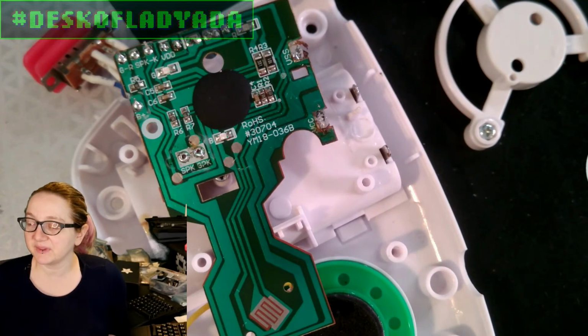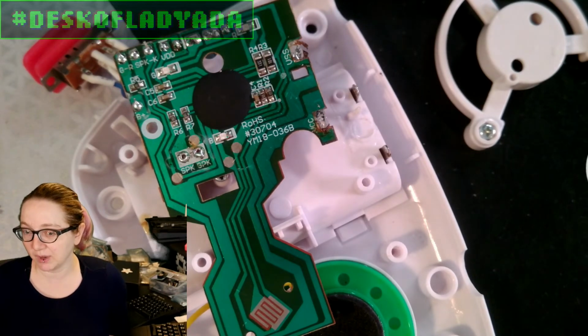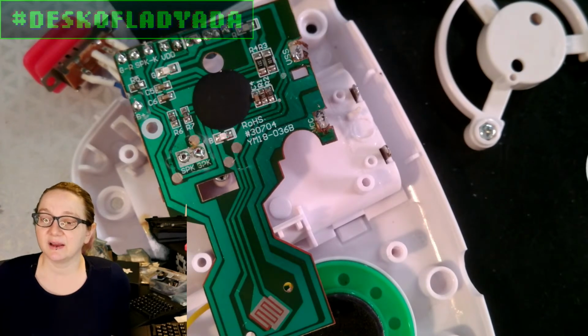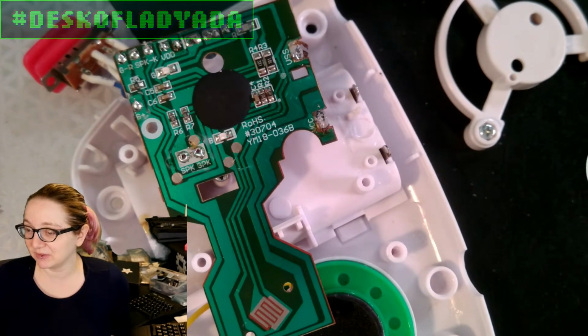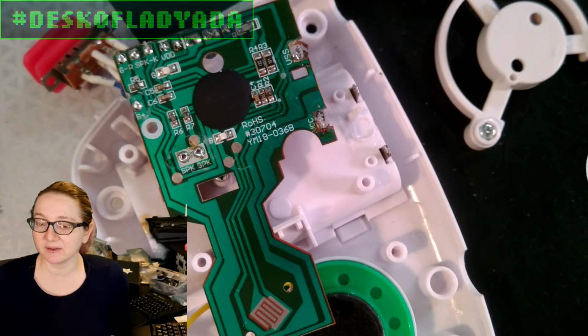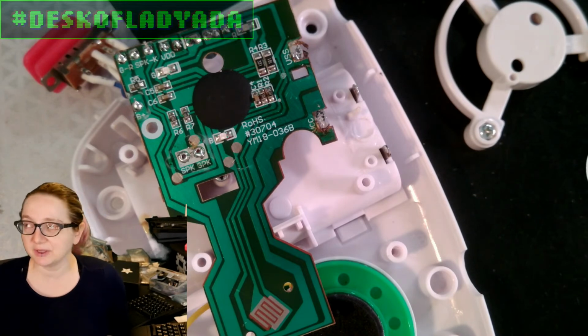So then the second option is we go with something like ESP32 C3 or S2. Those are kind of my two options. The reason is that those both have a ROM bootloader. You don't need a separate USB serial chip for them. And they both come in nice little FCC modules with antenna. And then you could upload the files over Wi-Fi, because we have a file uploader setup in CircuitPython, and also in Arduino, and both can easily play WAVs. I don't think we have MP3 playback in CircuitPython, so that gives us a reason to look into it. We should probably add it, to be honest. I think there's an ESP32 MP3 decoder for the Tensilica, and RISC-V maybe too.